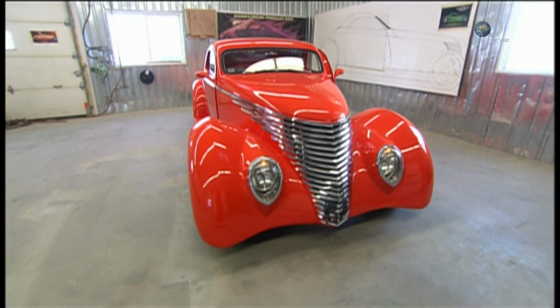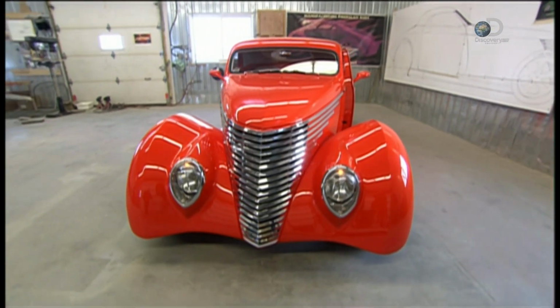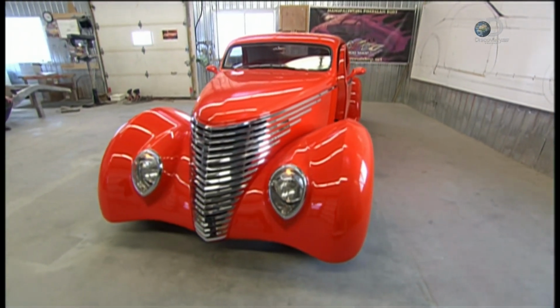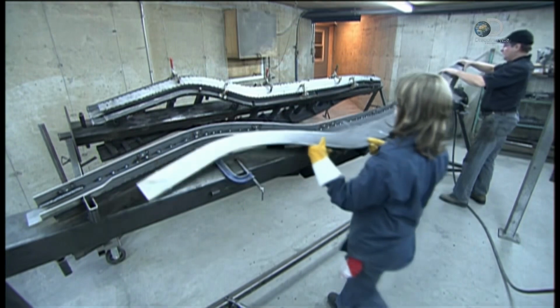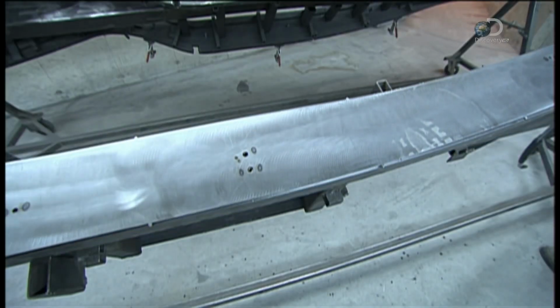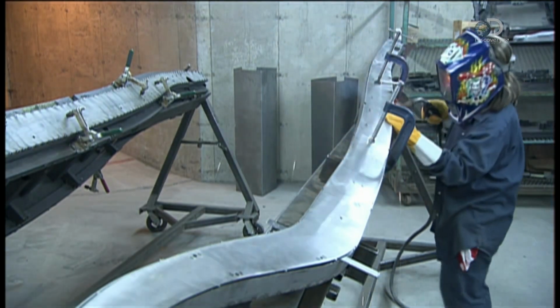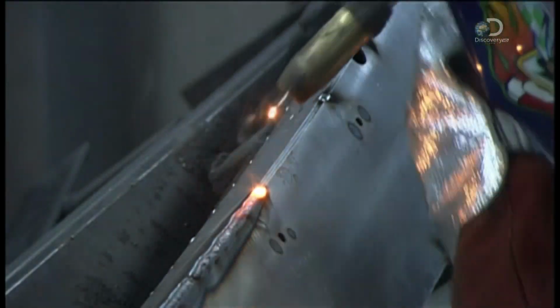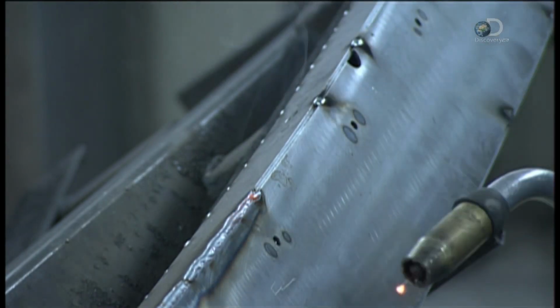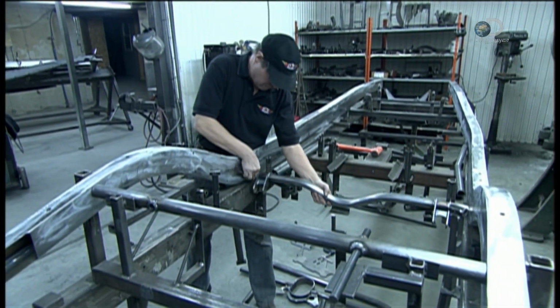The classic cars they start out as are pretty scarce these days, so specialty shops now design and build hot rod bodies from scratch, using state-of-the-art technologies. It all starts with curved steel rails, 4.5 meters long, that form the basis of the chassis. Every 30 centimeters, workers weld the rails to the car's frame. Next, they position cross members to reinforce the frame.